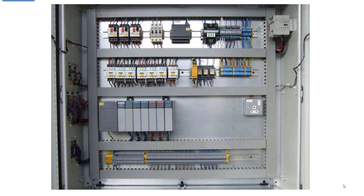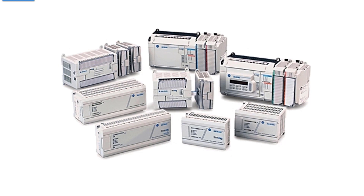You mount the PLC in a panel connected to terminal strips, and this is what it looks like. This family of controllers - all of these are controllers because they all have a processor and fixed IO. All the MicroLogix are controllers, not just processors - they all have fixed IO. Several of them have IO modules you can add on; right in the middle you can see an IO module sitting next to it with a ribbon cable connecting it - that ribbon cable is the backplane. They don't plug into slots; they just have ribbon cables that jumper from one module to the next.